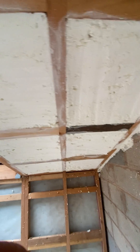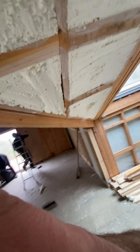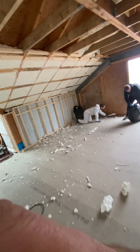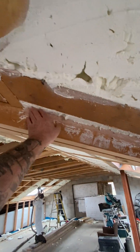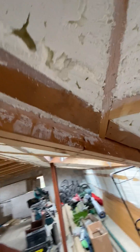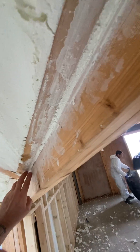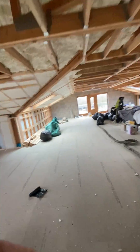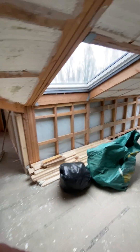You can see a seamless bond all the way around any intricate design areas. There are various areas along here with little bits to fill in, but these sorts of areas create a huge thermal bridge — you can't fill that with rigid insulation. There's no point using can foam and ending up with a layer that's only maybe 10mm deep.